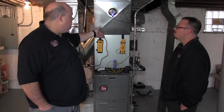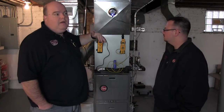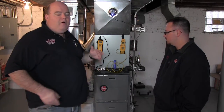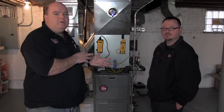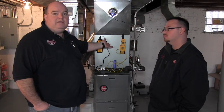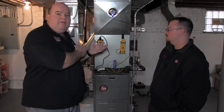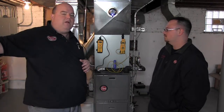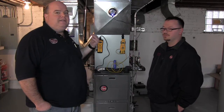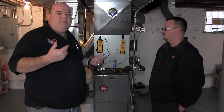With the water at 125, it's maintaining the heat in the house and working well. But look at how much more room I have — if I up the water temperature, the air temperature is going to go up and produce more heat. The whole idea is balance: it's about getting that return water temperature back below 107. Even if I go up 10 degrees, I'm still sending water back at the proper temperature to condense and fire at full efficiency. I don't want to run my domestic hot water that hot because of kids taking showers, and I don't have a mixing valve. I can still go up five degrees and be fine.